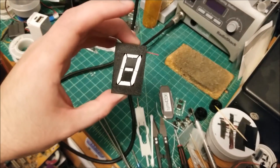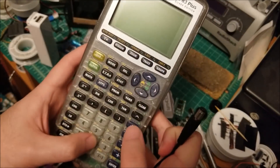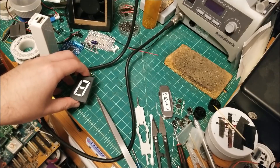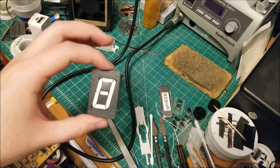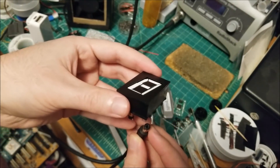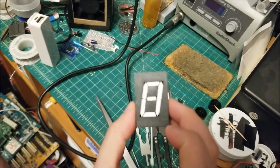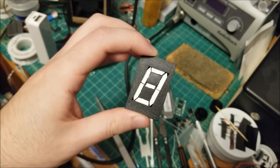I couldn't very well end this video without at least testing these out. I have a 12-volt DC wall wart, and if we run a quick calculation: 12 volts, these are about 45 ohms, that's 266 milliamps. The maximum rated current is about 350 milliamps from the datasheet, rated for 5% duty cycle. So I'm not going to be long — I'll just quickly touch it and release. It does work — I've tested it. You can see it just clicked off. So 12 volts will run just fine. I was a little worried because it's spec'd for 16 volts nominal up to 19 volts, but 12 volts works. The controller I designed is all set to go; I just need to receive all the parts and assemble.